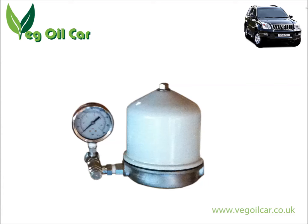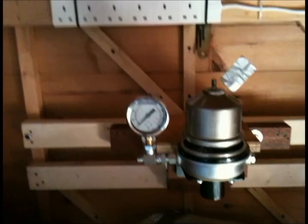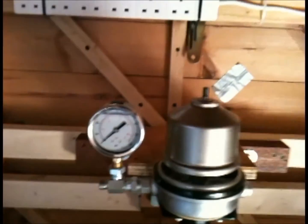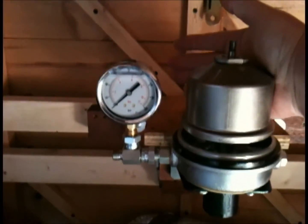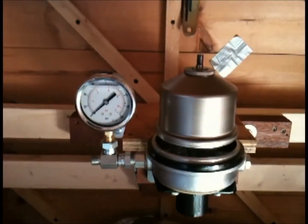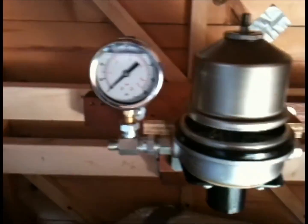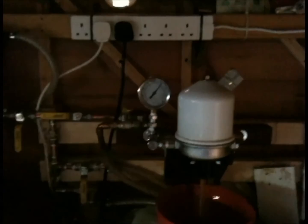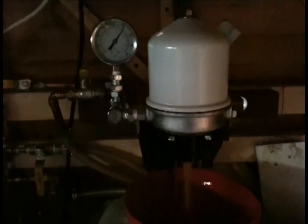The mechanics of the actual setup are very very simple. You have the outer dome which hides an inner cylinder, and that cylinder is where everything takes place. There are no fancy mechanisms involved — it's literally just a sealed cylinder with a couple of tiny pinholes at the bottom. The oil is forced in at high pressure by a pump, and jets out of those little holes at the bottom. As it jets out, the inner cylinder is forced to spin, so the force of the pump is translated into spinning movement. The thicker oil sticks to the sides; the clean oil has nowhere to go but fall out of the bottom, usually into a large container that houses the whole setup.